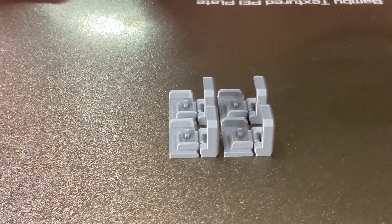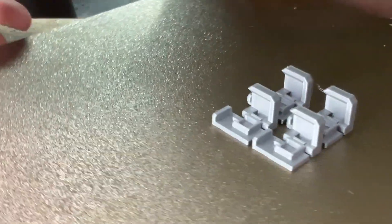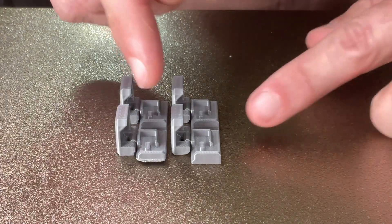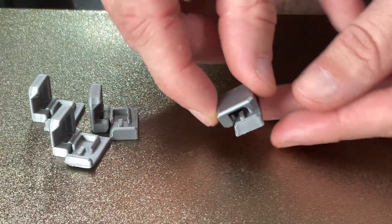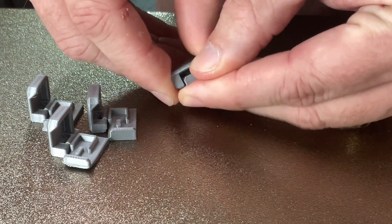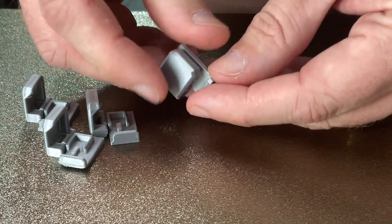Let's put this together — I'll show you the details and we'll see the final result. Since I am a 3D printing dork, I made these overly complicated. They are print-in-place. Here's how they print, just like this, but there's a hinge in them so that they close like that. The first couple times may be a little stiff depending on your printer and the quality it prints at, but you just do this a few times and they loosen up, and then you have a fully functional switch.